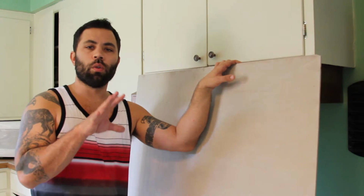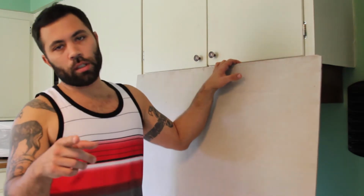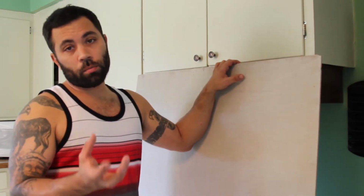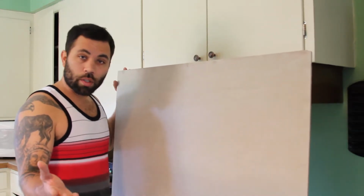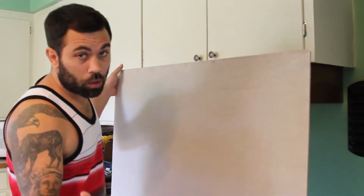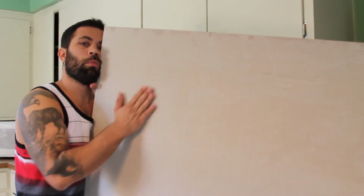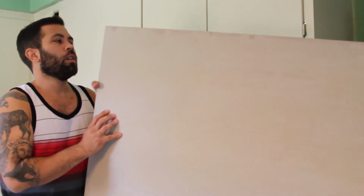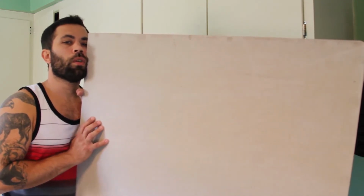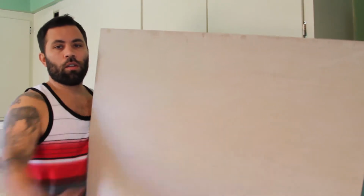All right, we're trying to put ceramic tile onto a wood floor. It's a big no-no to put it straight onto plywood. A lot of people make that mistake, and a lot of people waste a lot of money. It's a cementitious product on a piece of wood. Wood expands and contracts with cold and hot a lot differently than stone does. In a perfect world, all floors are concrete which receive tile, but sometimes we don't live in a perfect world. So they make things like Durarock, or this is a Hardibacker board. It's about quarter inch and cementitious, and you put it down on top of the subfloor plywood, stagger it against it, and I will show you how to properly install this.